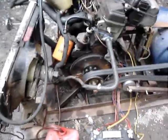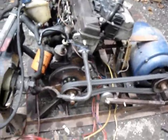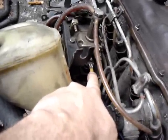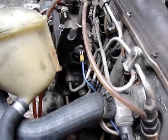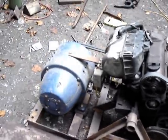This is just the first iteration — the beta version of the cooling system. It ought to be a hell of a lot better when I'm done. Of course it's going to have gauges on it — oil temperature, voltage — although I don't know if I'll have voltage if I don't have an alternator on it. Really, all this needs to run is this little thing right here — that's an electric fuel cutoff, just a solenoid valve that runs off 12 volts. As long as that stays open the engine will run. Actually, with one of these old diesels, you can take the solenoid out and the engine can run without any electrical system whatsoever, but you have to reinstall it to shut it off because then it won't shut off with the key. So far I'm pretty happy with the engine, and that's about all there is to that.